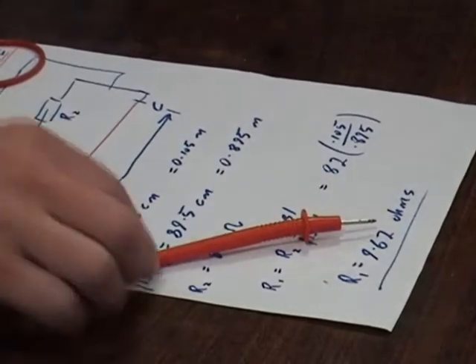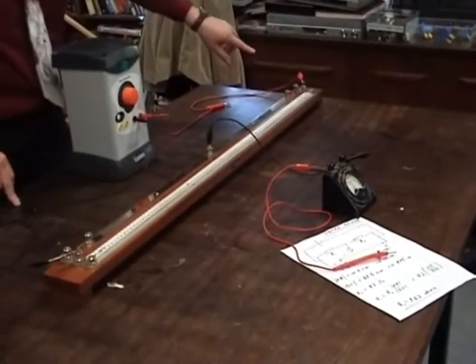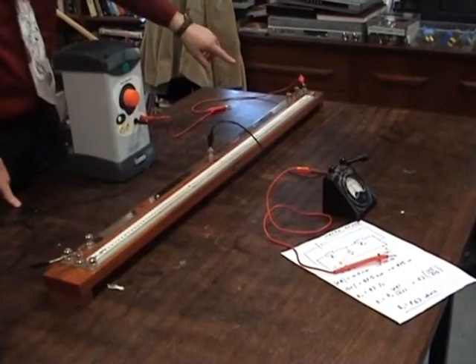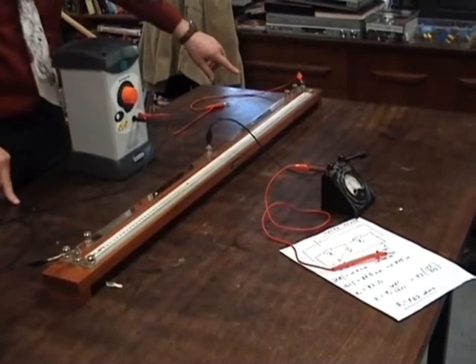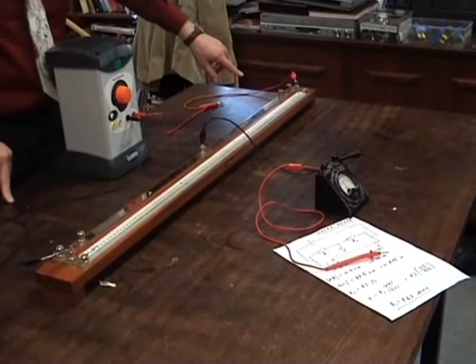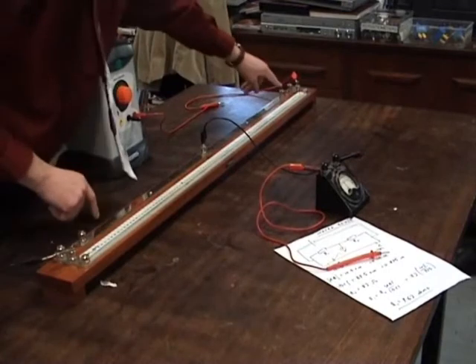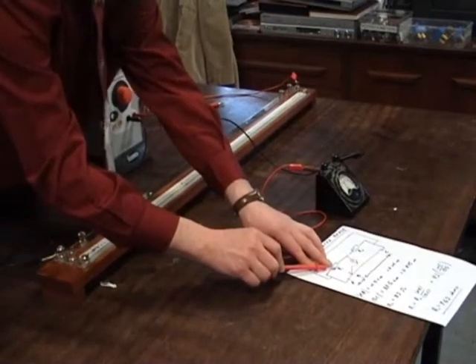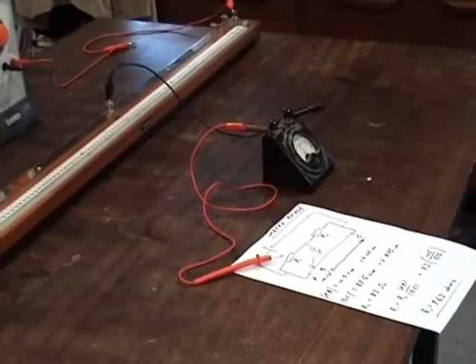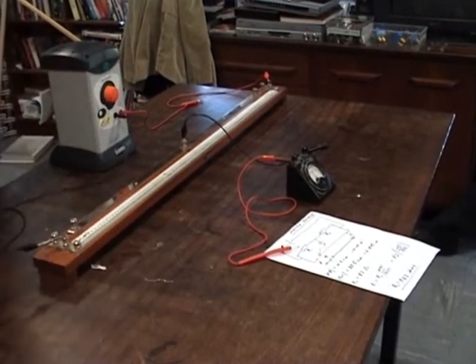So that's telling me the resistance of the wire is 9.62. So now what I've got to do is verify this — I did this when it was turned facing me, so while it looked like that it's 10.5. R1 is the unknown resistor, and it's this one here. So what I've got to do now is take this out and just measure the resistance of it, just to double-check it.